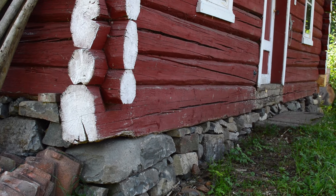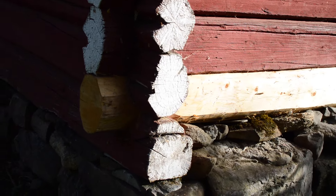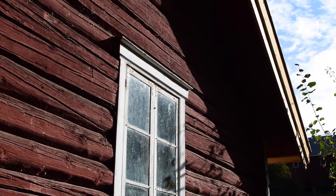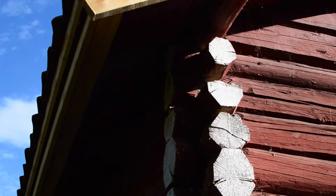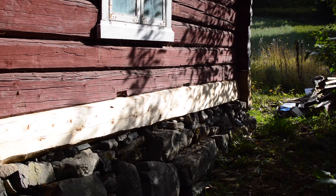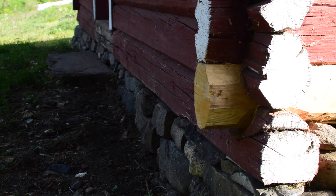The bottom stock's been out and back in again — that looks all right; it was always slightly twisted before I started. This stone wall actually isn't really quite in the right place because the whole house has moved 20 centimetres to the east, so it has a slightly unconventional look. But there really wasn't any more money in the budget to do anything about that — it would either entail moving the whole house, taking down the chimney completely, or lifting up the whole house and making a new foundation underneath, and that just doesn't stand in relation to the kind of building this is and its use. This is a repair and it is completely in line with what is normal and acceptable from a historical point of view.